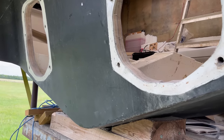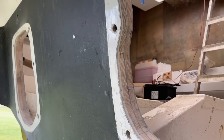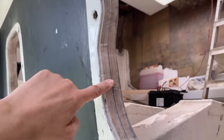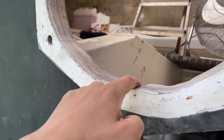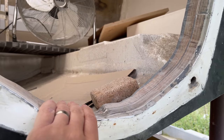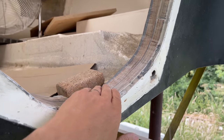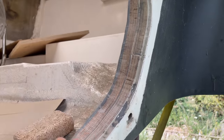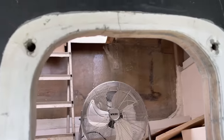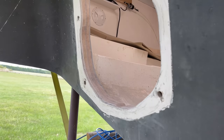Richard came in with the flat disc with 120 grit and that's made light work of this — looks lovely and smooth and more importantly, nice and dry. We were a little bit concerned that over the years there has been some water sat in here because there's no bilge pumps, it hasn't been pumped away. So yeah, a little bit concerned about this transom, but actually it looks great. We will put the moisture meter on it just to double check, but overall condition of this looks really, really nice, and the same deal over this side as well.